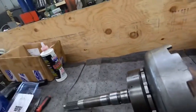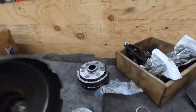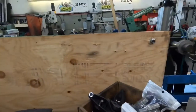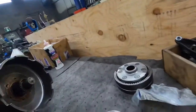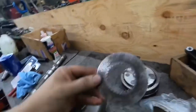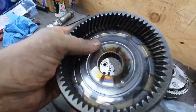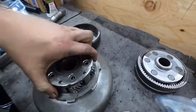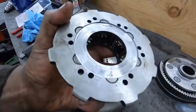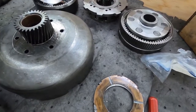I got some of the machining done here. I still have to do the front planetary but I got the rear one done. I still have to cut this washer down and this washer. You can see where I put that bearing in right there, and I cut that surface in there — this bearing goes there. That's the rear planetary and that's how you do that.